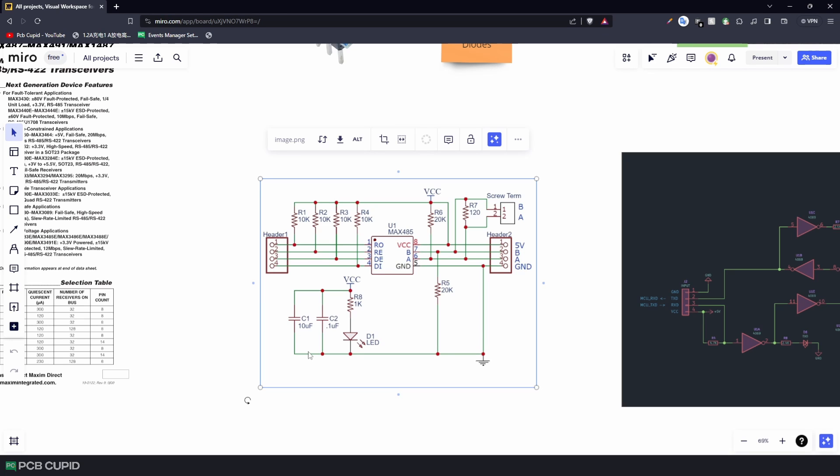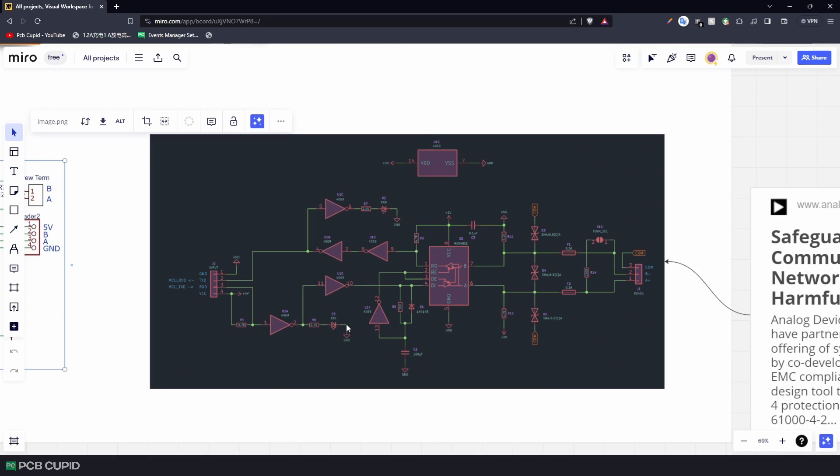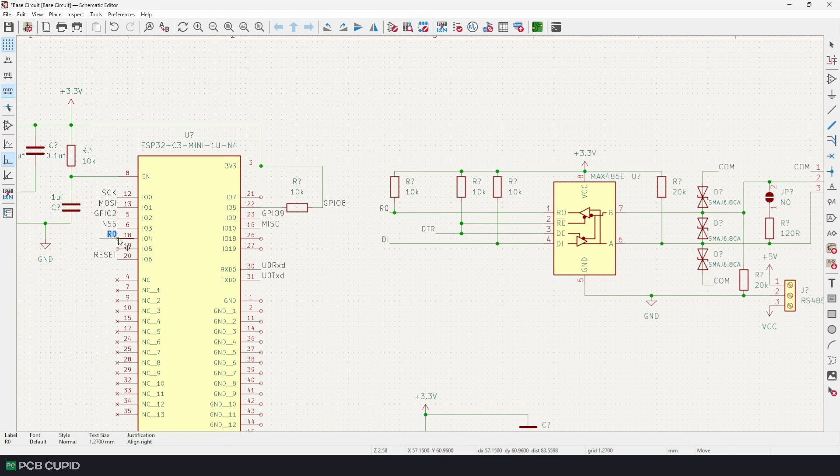I'd love to explain the reason for these resistors, but it's beyond the scope of this video — I'll give a link in the description that talks more in detail about the RS485 protocol. This first circuit didn't work well for me in the past with Modbus. So I chose the second circuit, which uses inverter NOT gates to handle the data direction on the RS485 bus, along with TVS diodes and a fuse to keep the bus stable. That circuit worked for me in all situations, likely due to the TVS diode preventing transient voltage. So I'm going to add the first circuit along with the TVS diodes.